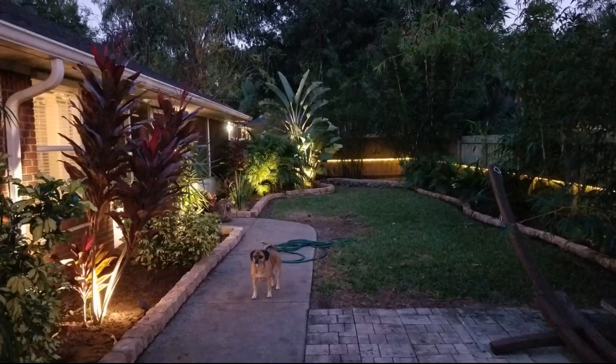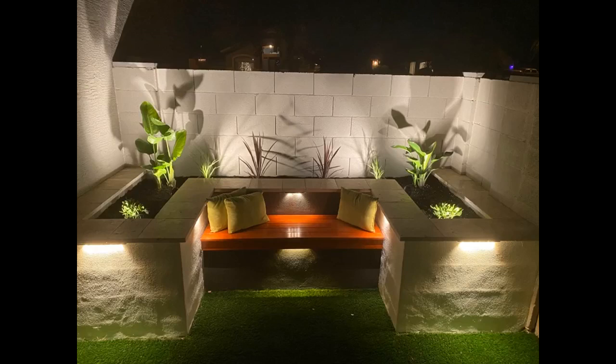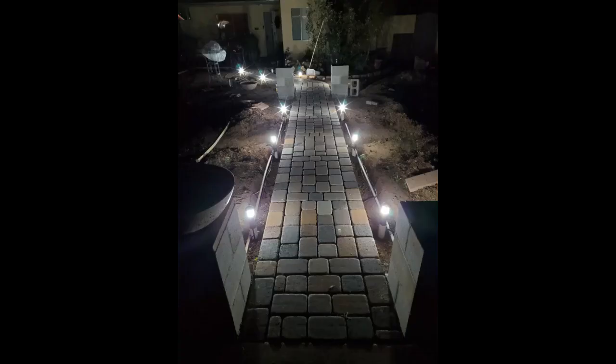Updated daytime photos as of 04-01-20. Beautiful powder-coated aluminum base, support stake, and main body housing. Ultra bright, super white LEDs. I placed a 12-inch long 2-inch PVC pipe into the ground 2 inches below my pavers — see sidewalk. I placed a split about 5 millimeters all the way down the pipe before placing it into the ground using an angle grinder. Prior to placing the piping, I used a 3-inch drill auger into the dirt then hammered the pipe down. I then ran the 12V cord supplied on each light through the spacing.